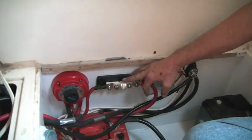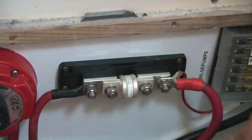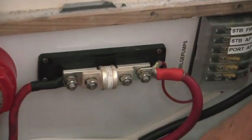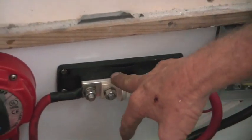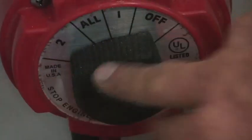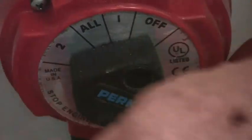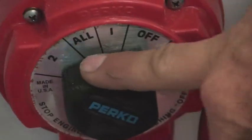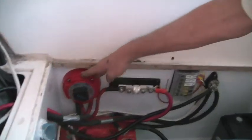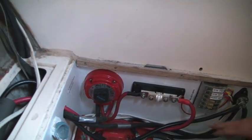We've got our main battery bank fused — I believe that's a 300-amp fuse — coming right off the batteries. We go from there directly into our AB switch, with one marked here on the side. One is the breaker panel, two is the windlass. Of course, that feeds out to their respective places.